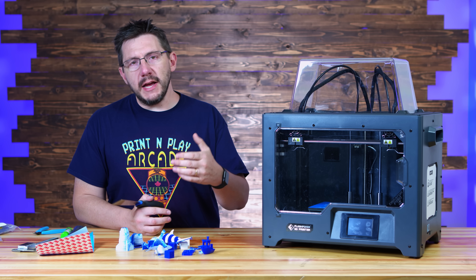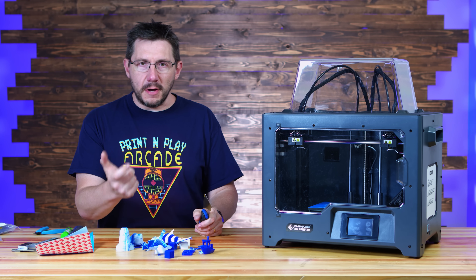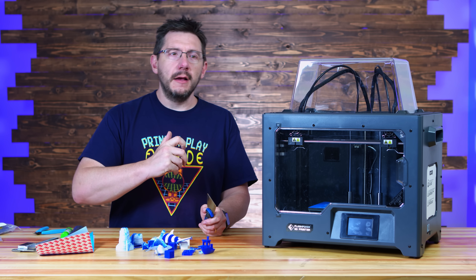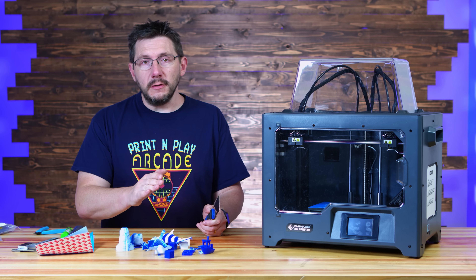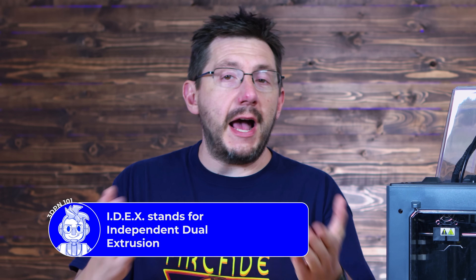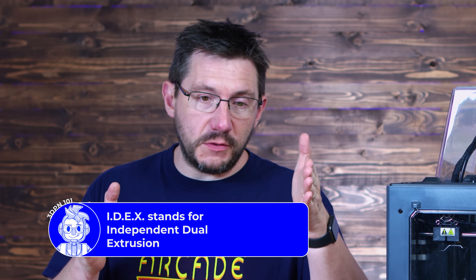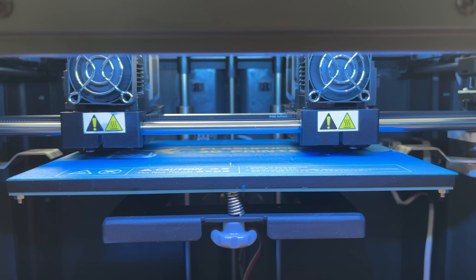Fast forward a few months, and I didn't remember it being as bad as I thought, so I thought I should really give this another go. I set it up on my bench and got to work. First, I leveled the print bed, and even though the thumb screws are extremely hard to get to and turn reliably, I was able to get a good level on the bed. Next was calibration of the offset for the left extruder and the right extruder. In an IDEX system, because they're going to be printing on the same spots, you want to make sure the machine knows where each extruder is at all times, calibrating their zero points relative to each other.